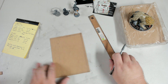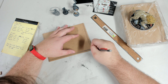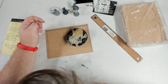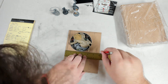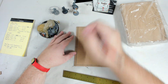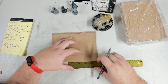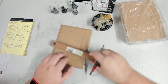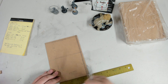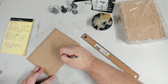I'm going to do a miter for the outsides, but I'm going to do something called a dado for the insides. A dado is a slot, basically — you see it in cabinets and other things. It's simple to do on the table saw. The reason for the dado is it will be stronger — it creates a slot that the shelf holding the models will act as a structural component. The tops of the box are a structural component holding everything, and the bottom is where the cards will be.